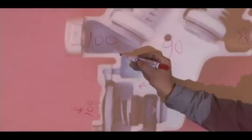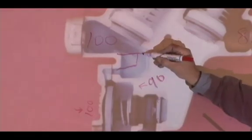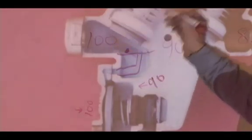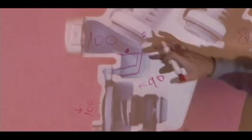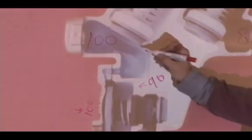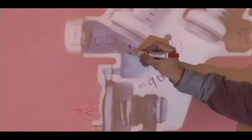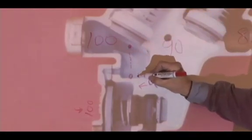Well, most assemblies that are similar to this have the body kind of go like this. There's not this lower area here. And they may have a little tube that comes down for the sensing line, something like that, on a solid body. Well, dirt and debris would line up on these spots on those other models, and as the water flowed in there, suddenly, boom, it would get caught in the first check and they'd have a check failure. So the Conbraco engineer says, I've got an idea. Let's put this small little catch basin in down here, so that as the water turns off and that dirt particle stops right here, instead of sitting there until the flow of water, it drops out of the way of the water passageway.